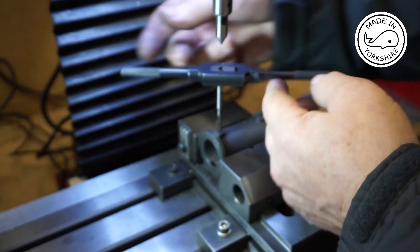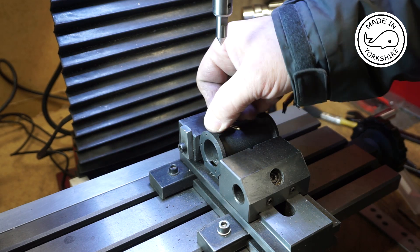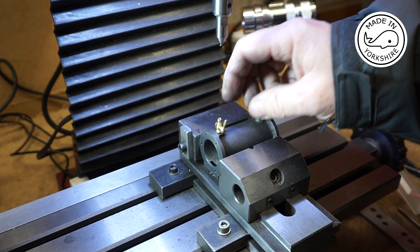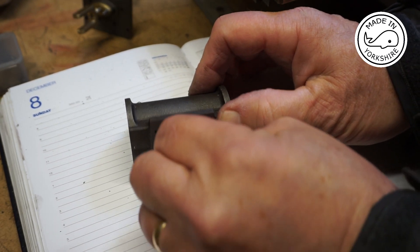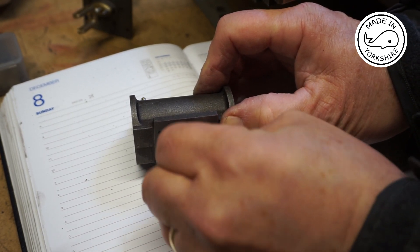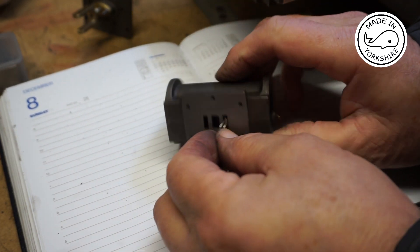Let's see that we've got enough threads on it. It's looking pretty good. So I'll do the other one but I'll do it all off camera. Now before assembly it's extremely important to make sure that these ports are clean and to get all the sand out, because if there's any sand in there it'll just wreck it. So it's a matter of wiggling that wire around, pushing it through to that port there and making sure everything's clean.